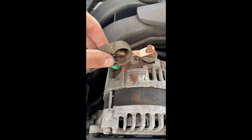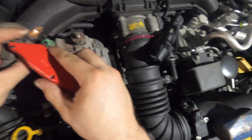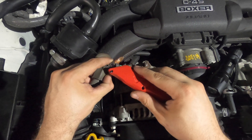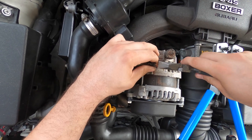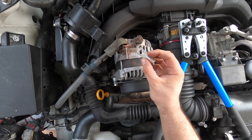We only have a little bit of wire here — it's not enough to make a new connector. So you're gonna need some box cutters to cut down the insulation and expose enough wire to go into the connector. Just cut the insulation along there, then twist the wires with some pliers to make it even. Now we're ready to put the new connector on.